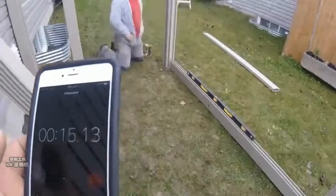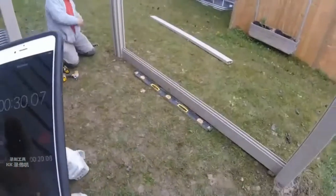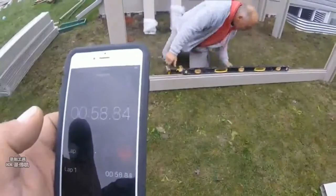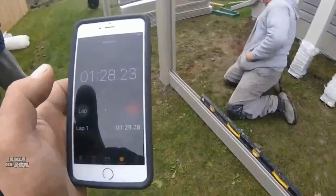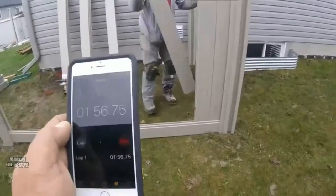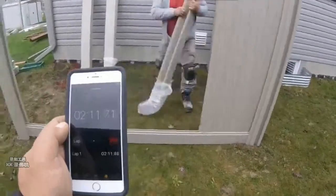And just to show you how much labor you can save here, this panel was made to fit, so there's 17 boards going in there with the bottom rails. The bottom rail is already in there, but I challenge you to do it with your routed system and see how long it'll take you to route the post, put in the boards, put in the top rail, etc.